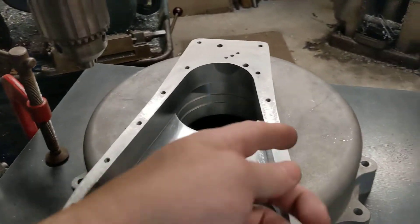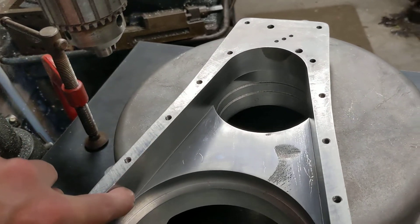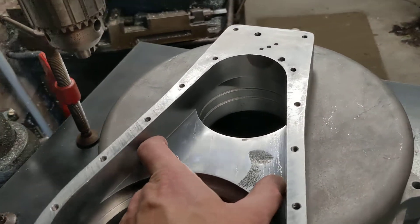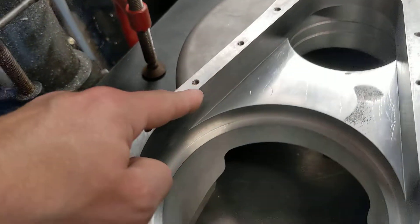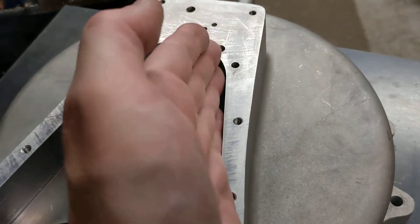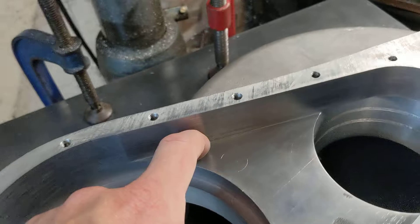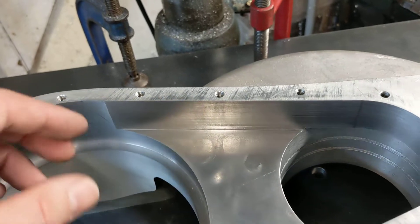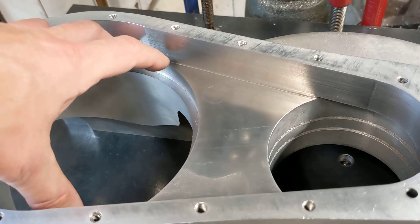In the last video I just finished milling this side here, and I've now finished milling this side here. The purpose of that was to make the maximum clearance possible for the timing chain, and also so that this circumference radius around here flows nicely into the straight edge — and at this end it flows nicely into the circumference again, into the straight edge and into the circumference, without coming in at the sides. That gives us a nice sharp edge here so that the chain tensioner we've made drops onto a sharp edge, which is exactly what we want. The maximum clearance for the chain is about five thou below the height of the main sleeve drive crank bearing, so that's fine.